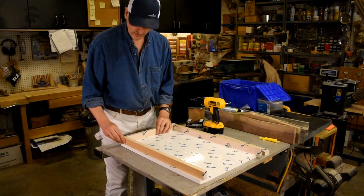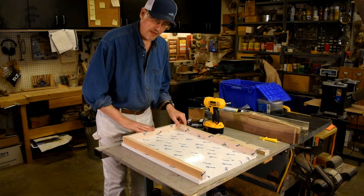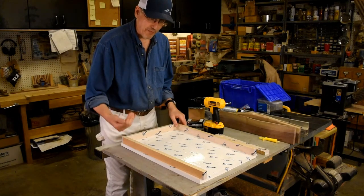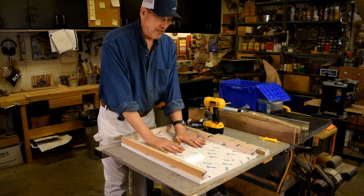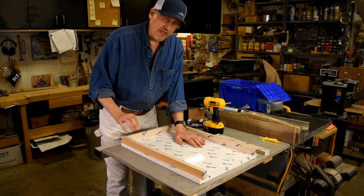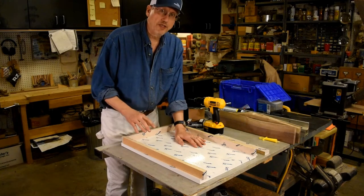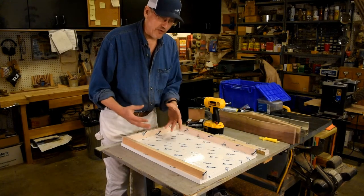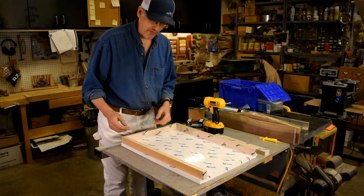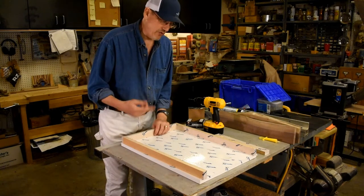First thing I'm going to do is screw the two sides to the end piece. Then from the bottom I'm going to screw all of that to the main base. All along the way, I'm going to put a very, very thin line of silicone between all the joints. I don't want much because I don't want it to bulk it up, but I want enough to make sure that nothing seeps through as the epoxy is poured. I'll do that now.